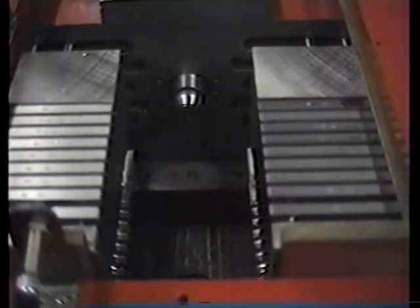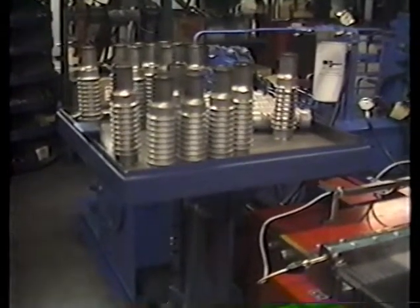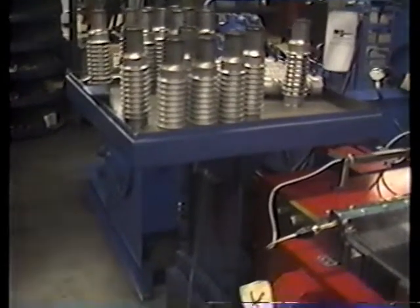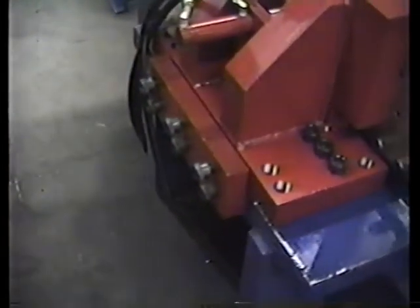It's something that we have to protect pretty vigorously. Looking down at two shafts that come down from the bottom of the plate — when these shafts extend, it sets the tube right on center so the operator doesn't have to install it manually. When the dies get ready to form, these shafts will come out of the way so we can form without the dies making contact with them. Looking at a little draining table where, after forming, the operator sets the parts vertical so the oil can drain back down into a reservoir. From this reservoir there will be a sump pump to automatically pump the oil back into the main reservoir, and it also filters it while pumping.